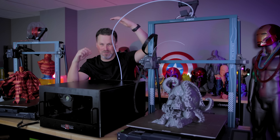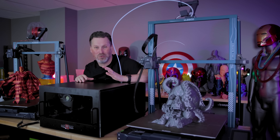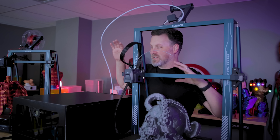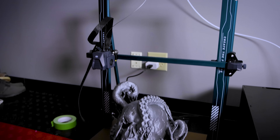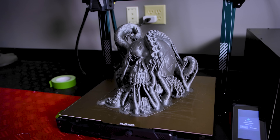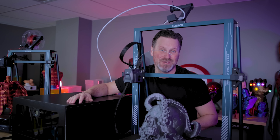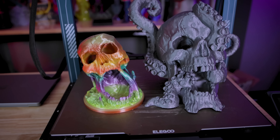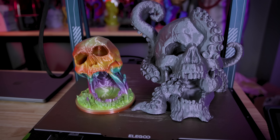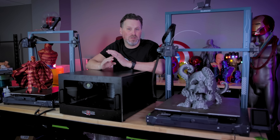It would make the entire volume of the 3D printer plus the box extremely tall, but it looks really cool. There is a large PTFE tube on the back of the RepBox that the filament runs through — I had it feeding in over the top of the Max and zip-tied to the top of the handle, and I'm debating making a 3D printable attachment. The filament then runs through the filament run-out sensor and directly into the extruder. The reason I was so excited about the RepBox is because I have some huge projects coming up that are going to require printing for five-plus days on the Max, and I didn't want to deal with filament run-out issues or swapping spools overnight.